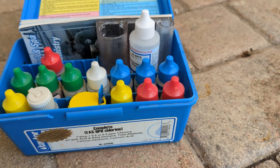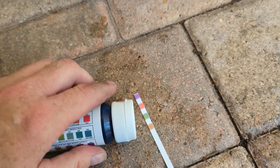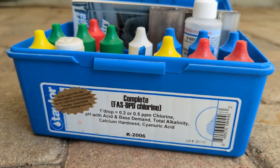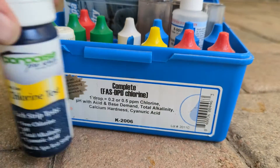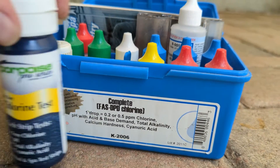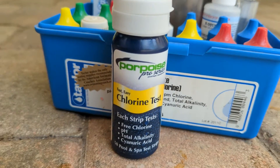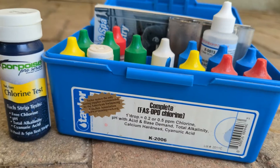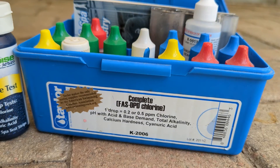I do love my Taylor K2006 kit, but for the money, these test strips — I tell you what, they're pretty good. The big reveal: the test strips I'm using are Porpoise — chlorine, pH, alkalinity, and stabilizer. Am I ever going to get rid of my beloved K2006? Absolutely not. But folks, for the money — you get 50 strips, I think this is costing me about 12 bucks. For the money and for the accuracy, these are one of the best I've ever used. For weekly maintenance, I think these would be okay. Testing test strips against the best test kit on the market — I think they did pretty good. Hope this helps you out, thanks for watching.